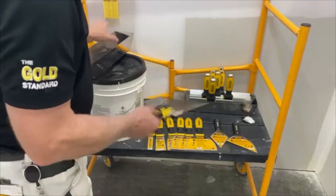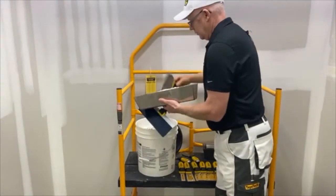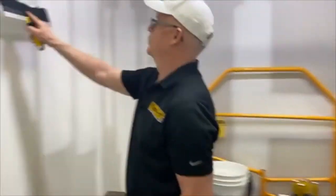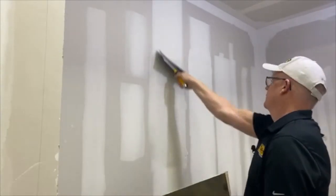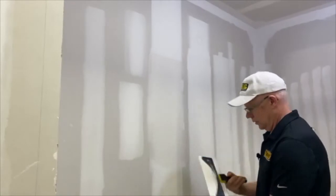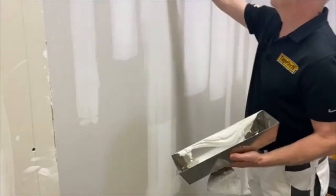I'm going to put a little bit of material in here and just spread the material on. I'll use a five or six inch knife, whatever blade I can grab. We're just using material that was just mixed. It's going to put a little bit of material on the wall — this joint's already been finished. I'll get my blade where it's going. We can just kind of smooth this out. The feather feels good. Again, that backing plate is really strong, so it gives you that support you need. The flex is really good, it just runs down the wall really well if you're pulling a joint.